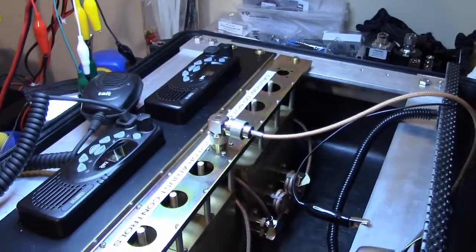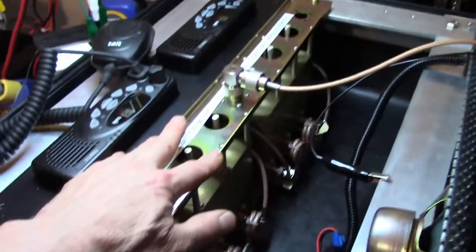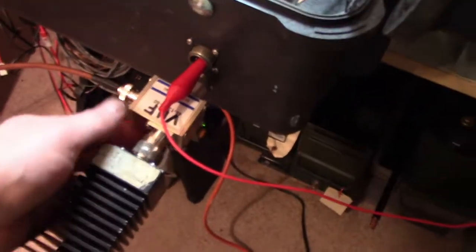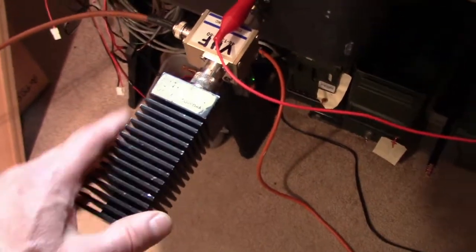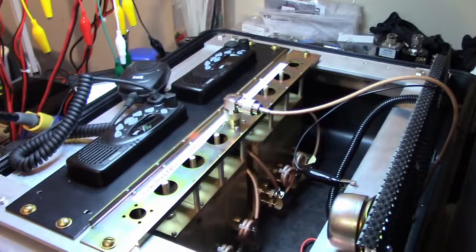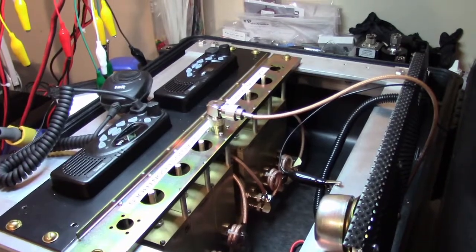That's how we test our repeater system. To recap: we tested the receiver first, the transmitter second, and we did a desensitization test on the duplexer using direct coupling straight to the IFR 1600. Our fourth test was using an external coupler — the Comprod decoupler — and running the signal into the coupler using the 50-ohm dummy load to take up the output of the transmitter. I hope this helps you. If you have any questions, please leave a comment below. Remember to like and subscribe. Thanks very much for watching.